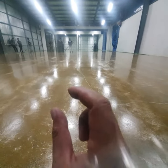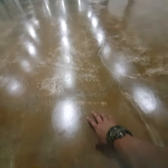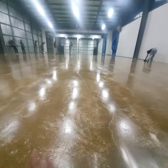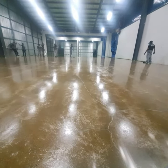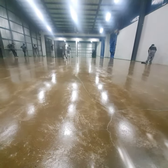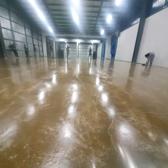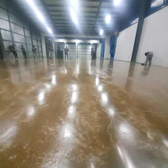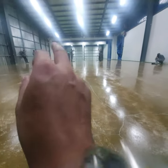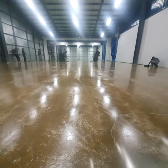Your first coat and your primer bond homogeneously if your primer is still tacky. With the labor time, you can imagine this is a 500 square meter area, and if you can just do the primer and the first coat in just one night, why not? So that's the second reason, but the first reason is for us to have a homogeneous primer and first coat. So again, that's us. Others would not agree, but it worked well for us.